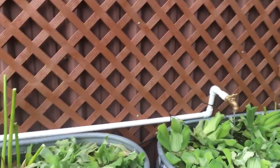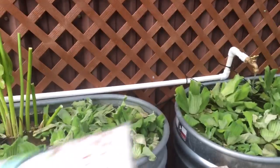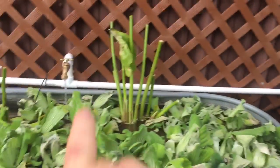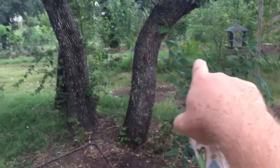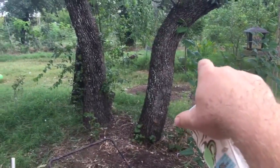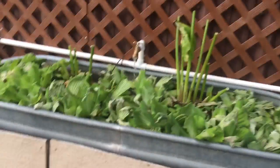And we'd create multiple points of failure with very little cushion. If they fail, we start having the system overdrive. In other words, too much water's coming in, not enough water can get out, we start overflowing the tanks. Sooner or later we kick in the float valve down there and shut it off, but that's when that system's drained. That's like an oh shit valve. That's not how we're going to run the system. We want the system to stay stable and balanced, okay?